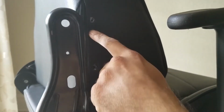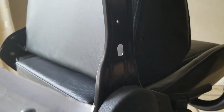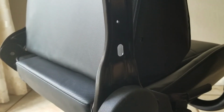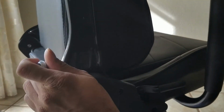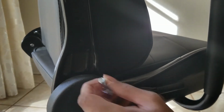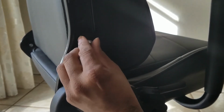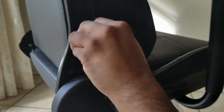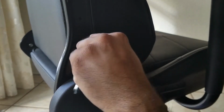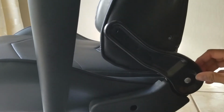And again, to connect the chair, we're going to be using these heavy duty bolt thingies. And similar to before, start from the top. Connect 1 screw first, then connect the second one. That way you have aligned it completely properly, and loosely tighten it, because we want to connect the other side too. So hand feed it first, then tighten it slightly, then rotate to the other side, and now we can connect this one. And at this point, considering I connected it to the part that was not moving, as you can see the chair is steady and it's not giving me too much of a hard time.